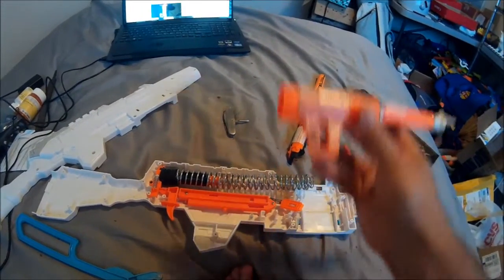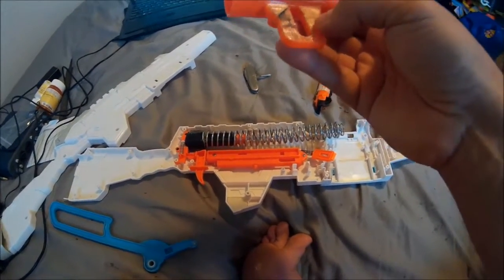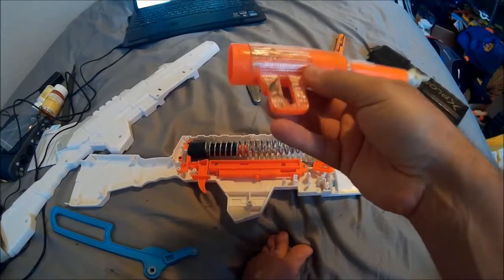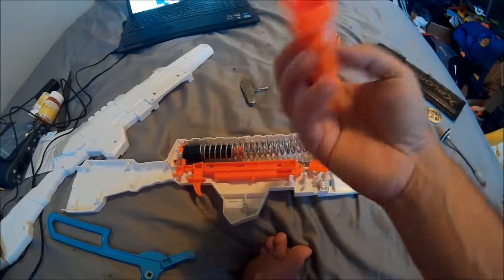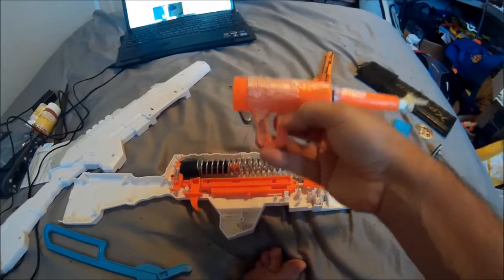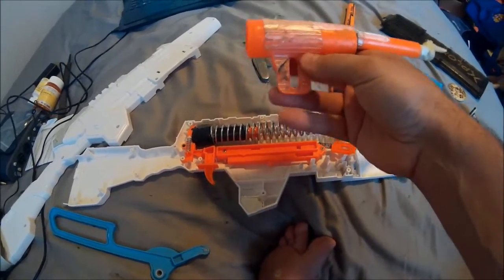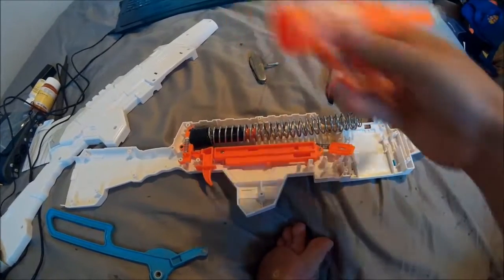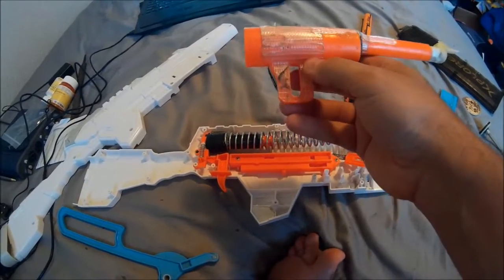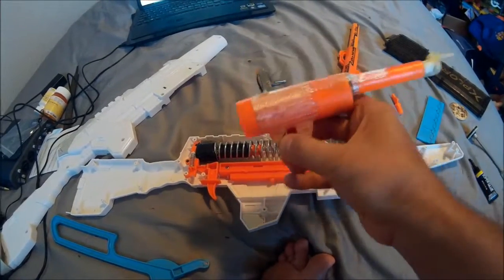Okay, so here's the U-junction right here. It's got two layers of fiber tape that are laminated with epoxy inside of it. On this thing, you'll have a pocket. Then your next pocket will be on this side. And then your next pocket will be on that side. It separates them. So what I did is I took out the wall here, wall here, wall here, wall here. I laminated this one side, filled the whole thing with epoxy. So the epoxy chain is all the way around this loop. Completely around this loop, so that this is one solid piece of epoxy, and it has no plastic dividing it.